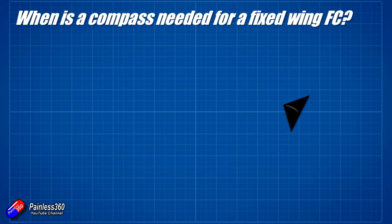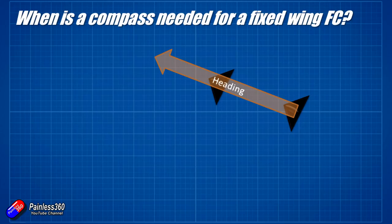What it can do is quite a clever trick. Flying along in our little black wing, the flight controller knows the GPS position quite accurately for each location and is constantly monitoring it. The really cool thing is: if you draw a line between those two positions, that is the heading of the fixed wing. The reason you can do this on a fixed wing is because it should always be flying forward — the front of the craft is always the front of the craft. Whereas with a multirotor, it can fly in any orientation: backwards, front, left, right. So this shortcut works well on a fixed wing.